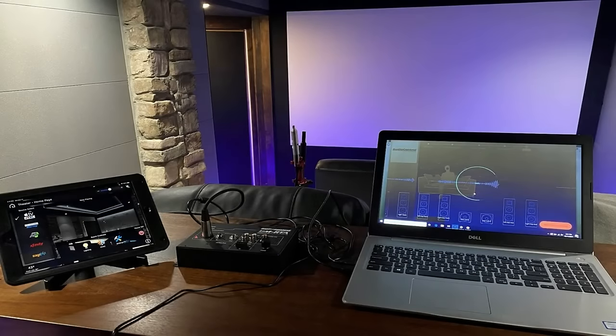The other thing I wanted to go over is just a few of the other things that we do when we calibrate a system. So as you'll see on this screenshot, we have our remote control fired up, of course, but we have a audio control RTA. We have our laptop open, and we do two things on our larger high-end systems, and most integrators will do this, is we calibrate the speakers so that all the speakers are the same levels. And we actually try to do this before we run any Audyssey or Dirac or any of those. It speeds it up and just helps it out, and it's how it should be properly done. So you don't really want to set the gains in your processor.